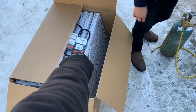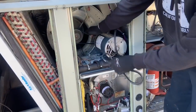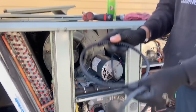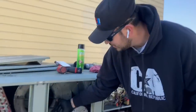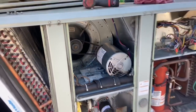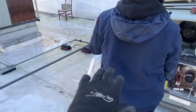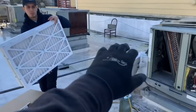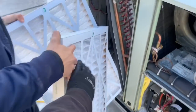Now shut the unit off and we're going to replace the belt. Grab that belt, take this one off, get the new belt, go inside the old belt and just push it out — that way you're able to save the old belt. You always want to have about a half-inch of play on it — see this? That's perfect. Even though they're pretty good in shape, still replace them and put the name and date on them, because you don't want a customer to say you didn't change them. Remember, the metal mesh always goes toward the evaporator.